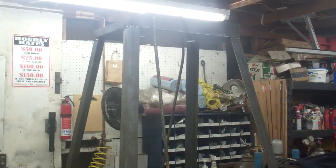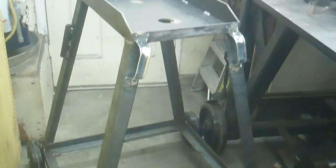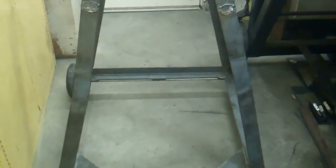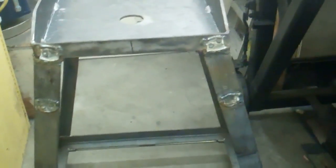I got all the pieces welded in there — now I just need to take those pieces of rebar off and finish welding everything. I got it almost done and just put the handles on here. This cutoff saw has a clamp on it and I put this piece of pipe here for it to go, but I'm not using it. What I ended up having to do is when this was on the bench, I measured everything a whole bunch of times and everything appeared to be straight, but when I got it down on the floor I could see it was off a little bit. So I cut it off at three of the legs, heated it up, and twisted it a little bit to get everything lined up right. When you make the bottom base bigger than the top, it's hard to get everything lined up right.